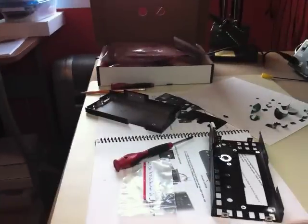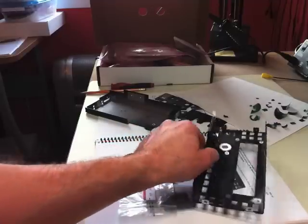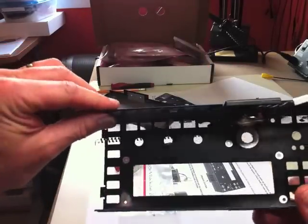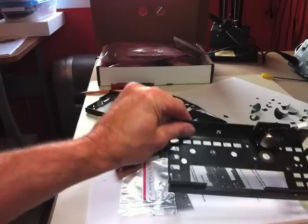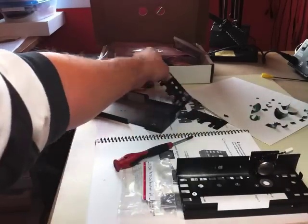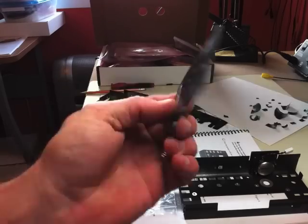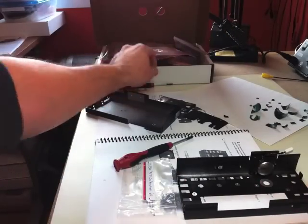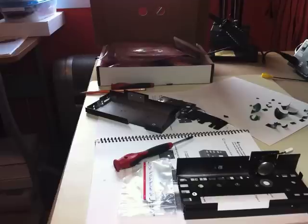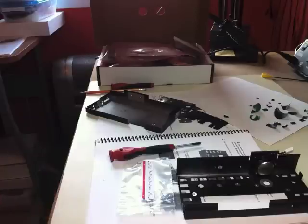Welcome back. The next step involved the enclosure components — specifically, some tape that has to be removed, which exposes bare metal contact areas on the Elecraft KX3 enclosure. On the front panel you can see bare metal spots where tape was removed. The assembly manual shows exactly where these spots are, including some on two sides of the panel. The tape comes off fairly easily, usually in one piece — it's on firmly but can be started with a screwdriver and then peeled off by hand.